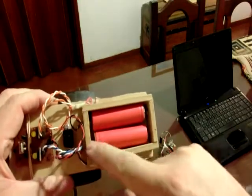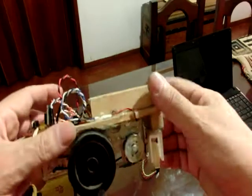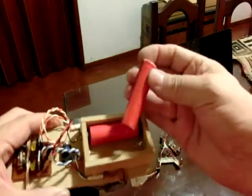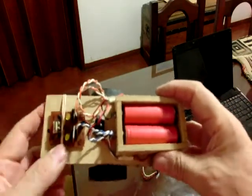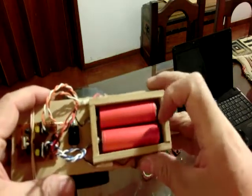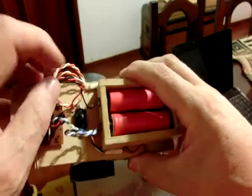Moving to the upper part, we see a kind of battery holder, also made with wood and always glued with the silicone gun, where two 18650 lithium batteries are housed — recycled from old notebooks. As explained in another video, two of these cells are placed in series and power the entire set, both the electronics and the motors that provide traction.